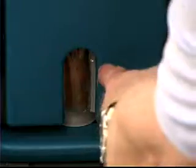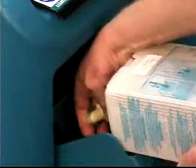When fast scrubbing, check the optional Fast Pack concentrate agent level and replace the carton as needed. To change the Fast Pack, tilt out the Fast Pack holder and disconnect the used Fast Pack. Insert a new Fast Pack and connect it to the quick connector. See the manual for instructions concerning replacement of the Fast Pack.